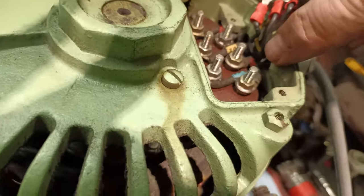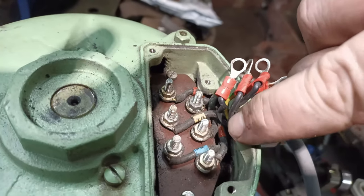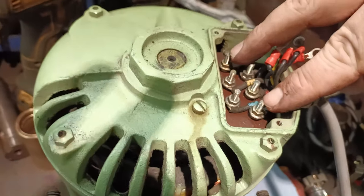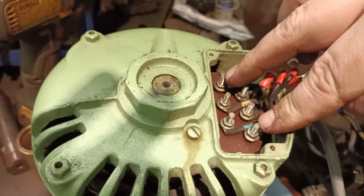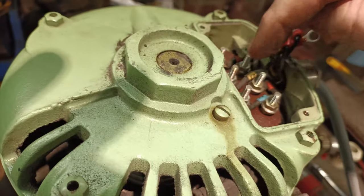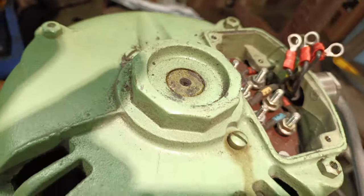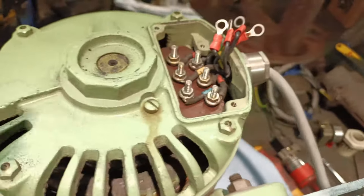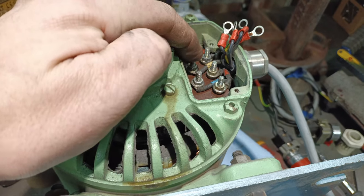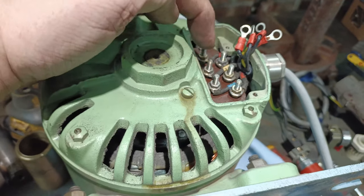The only problem was I didn't know which way around the other cables were, because I couldn't see the blue or yellow labels. So I did the same thing — measured the continuity. I know that's A, I know that's B, so I measured B and confirmed that's B2, so B1 and B2 are identified.